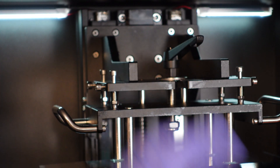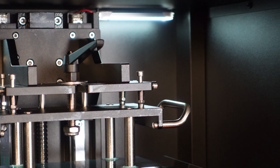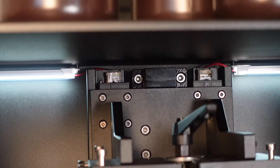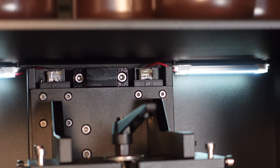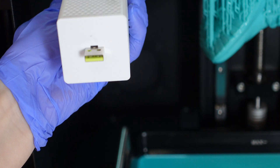The build platform is not particularly my favorite. It requires you to loosen the screws and loosen that top bolt, but leveling gets complicated because when you tighten up that bolt it lifts the build plate. Leveling it completely can be tedious and take quite a long time, but I do have a way to fix that which I'll show in a bit.